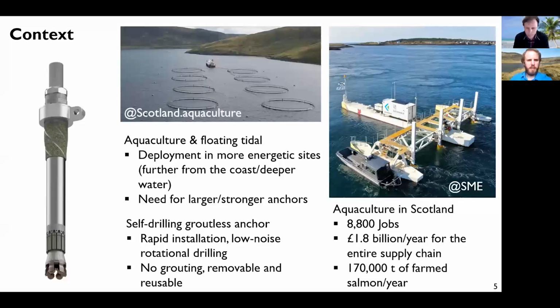Another question. So this is static. That's the static pull-out capacity. What about cyclic loading? Not so much doing the analysis, but the sensitivity of these anchors to cyclic loading? Well, this is indeed the next question to be investigated. We thought about it, obviously, but it was just a 4-month project, so we didn't have time to go that deep into the details. Sure. But definitely the cyclic loading will be important for the rock.